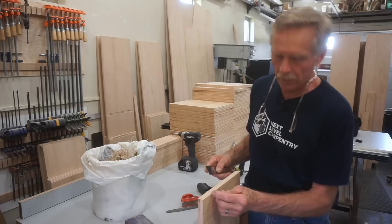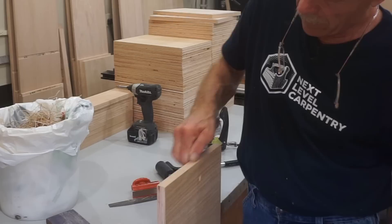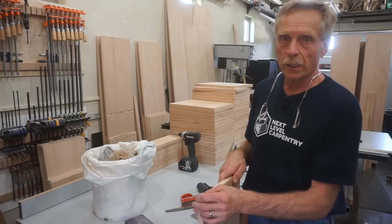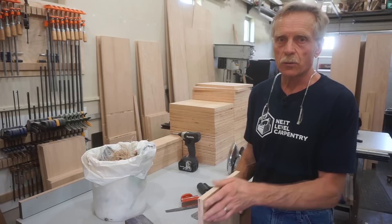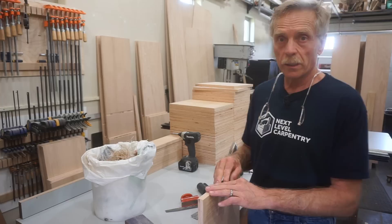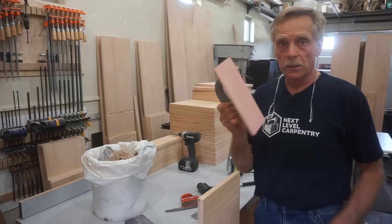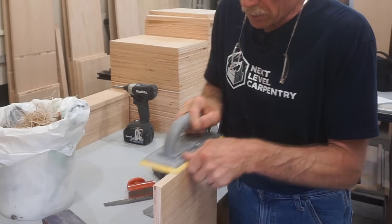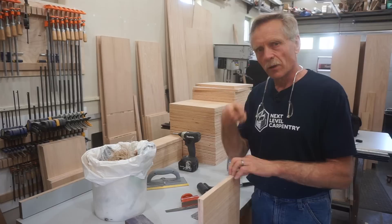After completing those steps, if I have any doubt that there's still hot melt glue on the surface, I take a sharpened putty knife and just give a quick wipe. I don't have to do that very often, but it'll catch if you miss anything on that edge. You'll feel the knife slow down and you know you need a little more attention. But once you're practiced at it, it's a quick deal. Everything from the beginning to this step is the same for doing melamine edging on particle board and wood. The last thing I do is take this squishy soft 120 grit sanding block. The iron can tend to burnish the surface of the wood, so I just take a couple licks so that surface is roughened up a little bit for when I stain it, so the stain takes evenly on all surfaces.